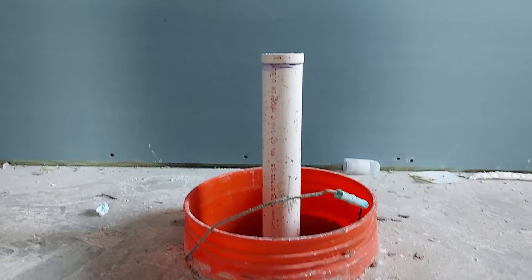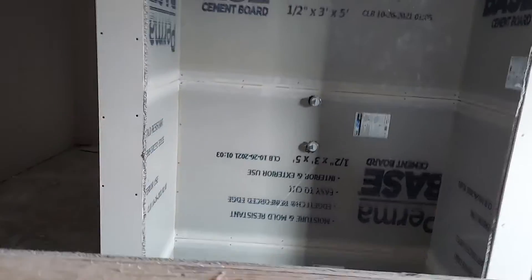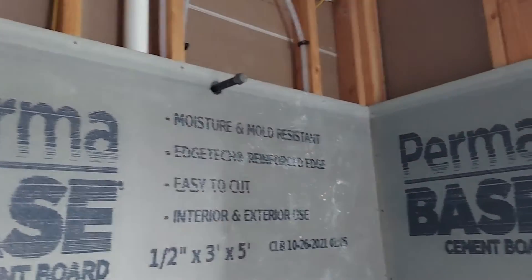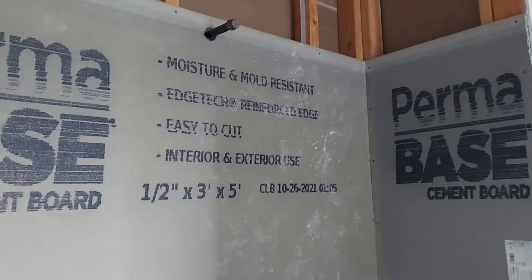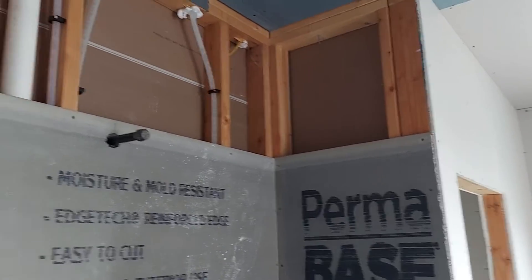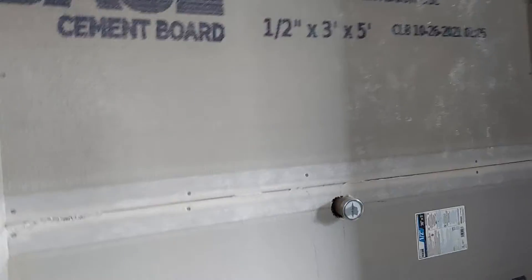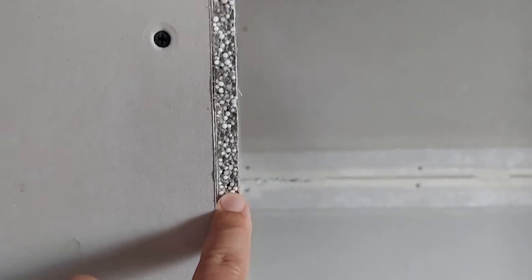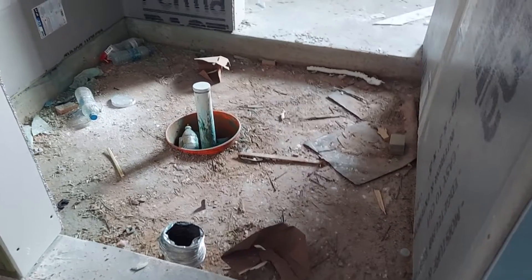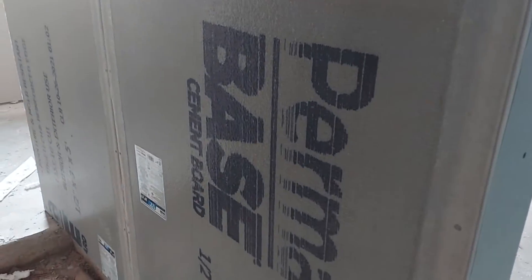For some reason, I guess it's to protect it. A sign of a good quality shower is they use this concrete backer board, the cement board, and they go pretty high up. I probably would have gone all the way up just to waterproof it well. It sounds kind of crazy but I like to fill those void areas with insulation so you don't hear a lot of noise from another room. This is a perma-base cement board and they did a pretty good job with it. Down here they did the five-gallon bucket with that drain pipe, so that's going to be where your shower pan is, and the whole wet area gets that perma-base cement board.